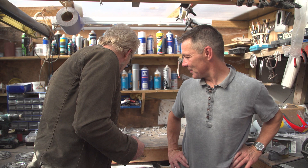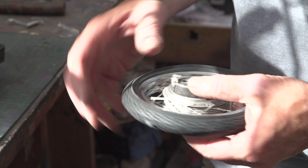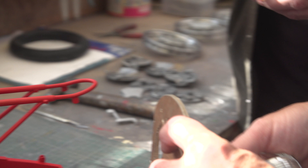I want to talk about the wheels because I'm really amazed — the hubs and spokes are actually done by hand. I build them all up by hand using a jig. The only bits that are CNC machined are the rim and the hub — my friend Ed makes those for me. The jig helps you keep the two parts in orientation while you're putting the spokes in.